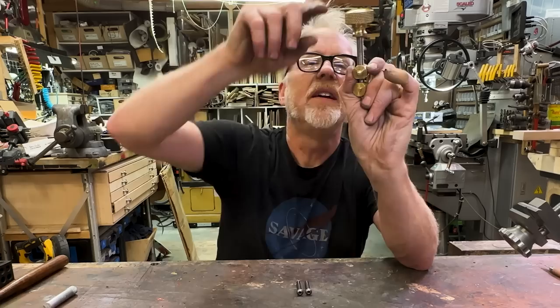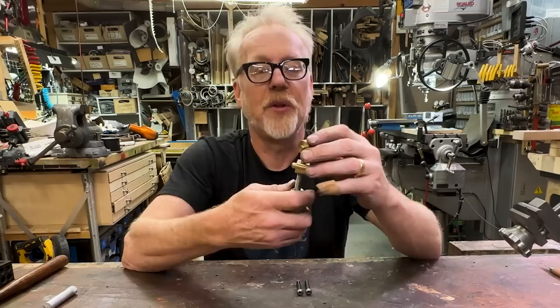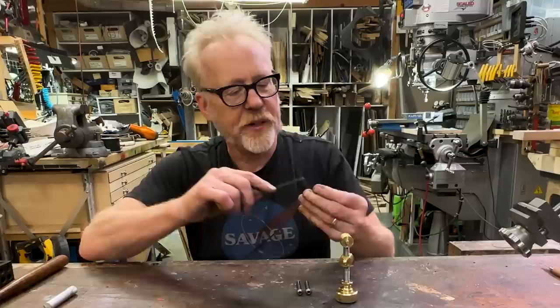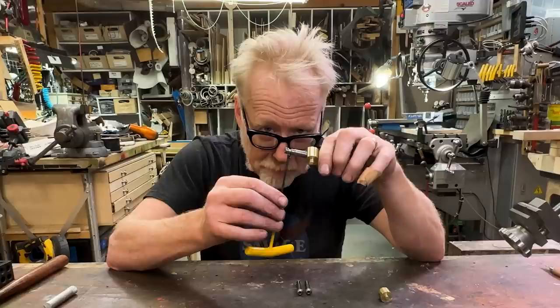That is how the clamping works. When I close this down, it brings these together. When I open it up, it moves them farther apart. And therein is all the action inside of the clamp knurler, stemming from those two pieces. To put the captured nut on there, you want it captured. So here is a little set screw. I actually custom turned this set screw so that the end fit nicely in there without chafing it. I didn't want to mark it up. And also, I don't want to put it in so far it actually touches that centerpiece.